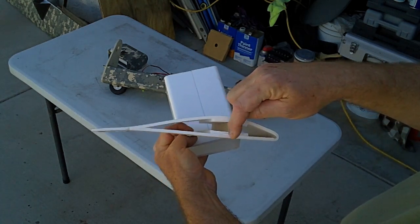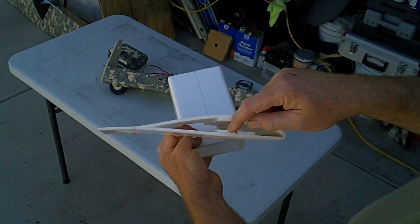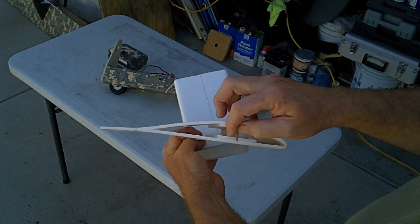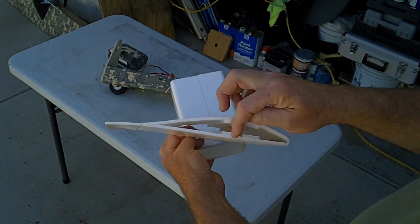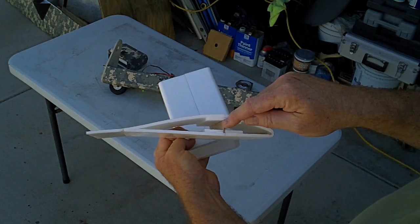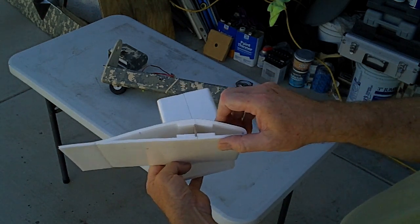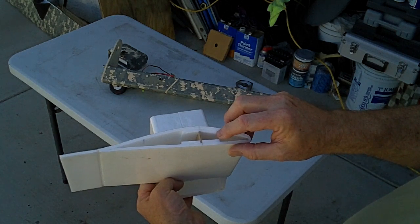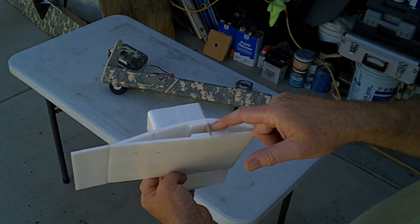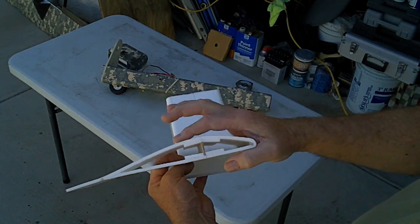This is 2/3 of the wing, right on the center of that spar. Make these 1 inch. These could be 3/4 inch, they could be 1/2 inch, but it kind of stiffens up this bottom area at 1 inch wide, which is real nice. Hot glue those down as locators. Hot glue down your spar, and then this other locator, just butt right up to it, hot glued. Now this piece on top is 2 inches wide, this doubler on the inside. I peel the paper off of the inside of it so that it will curve down and disperse this to give a nice radius